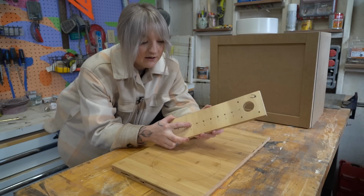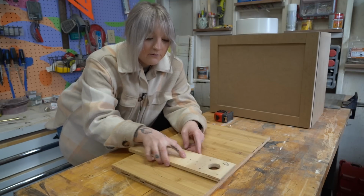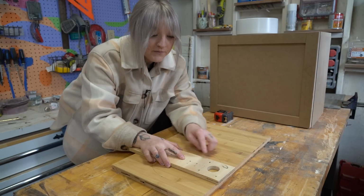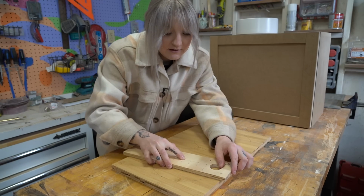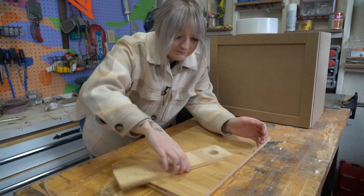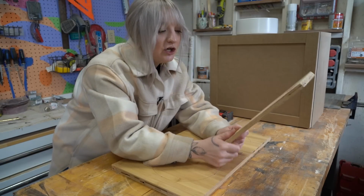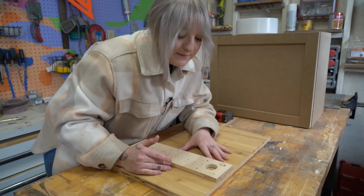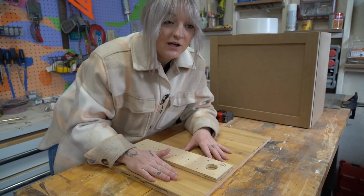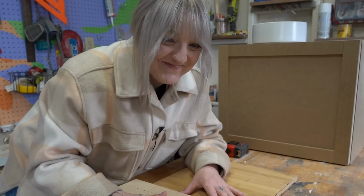Essentially you take whatever the diameter of your circle is, and what is half of that. Then I will find my middle mark, line up my jig or my router with the proper bit, and then we just pivot it around the circle until we're done. And then Bob's your uncle, we got a circle cut out. Homemade jigs for the win! But we really only have one shot to do this. So don't mess it up, Danie. No pressure.